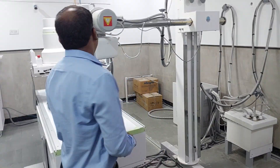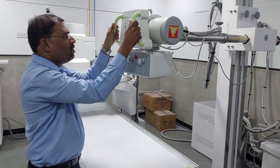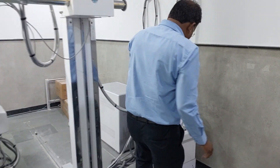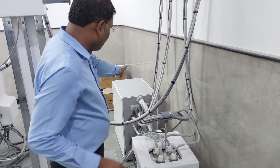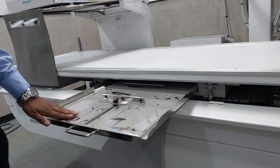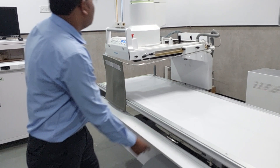Second thing — this is your X-ray tube of the machine. With help of this you can move the X-ray tube and tilt it. They have provided angulation here. You can adjust the collimator with help of these two knobs. This is nothing but the HT tank — it is required for the production of X-rays. This is your controller of the machine. This is your patient table. For putting the X-ray cassette you can put it here — they have provided lock and unlock. Press the cassette in and release — it automatically locks.